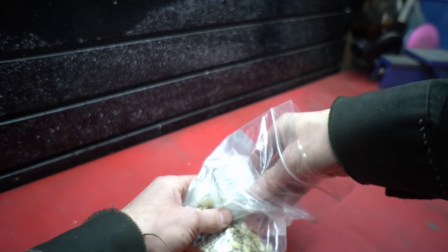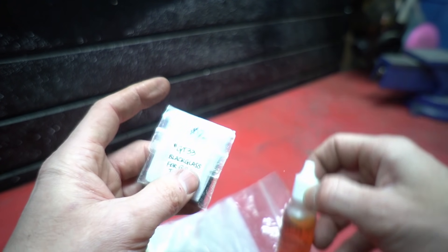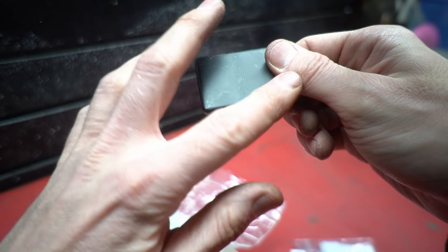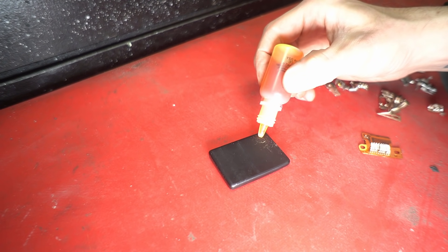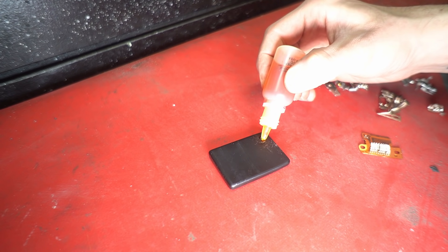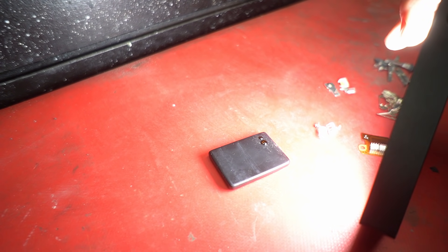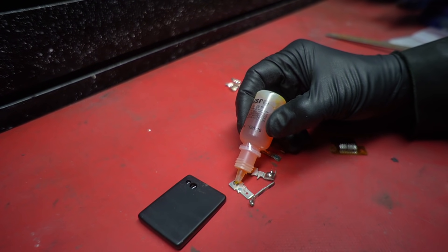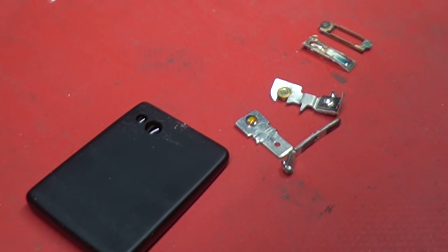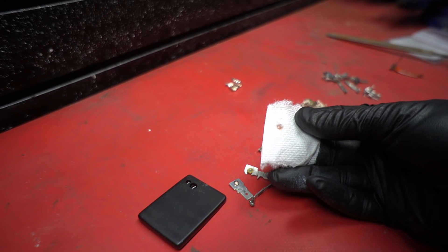To actually test it, you can get a silver acid test kit like this one. The acid isn't expensive, but it's good to have a testing stone as well, because the acid is basically a weak aqua regia, and if you were to use it on something like sandpaper it would eat straight through it. Let's give it a try on these pieces. We'll try both the place where I rubbed it and the rubbings. It doesn't seem to be eating it away at all or changing color. It should turn bright beet red if there is silver. There we are — that's the red color we wanted.